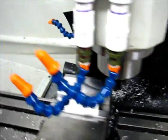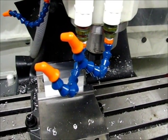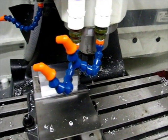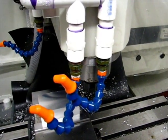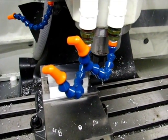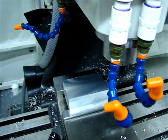What I realized was that the cut that I'm taking, primarily since the table's in the position over this way and the tool's up in this corner when it's in the home position, my primary cuts are going to be coming from over here, going this direction. If I'm climb cutting or doing finishing operations, it'll be headed this direction, which is one thing I showed on that part that had the arcs on it all pointed in the same direction. That'll be the case for a lot of parts I finish, I'm sure. So instead of messing around with it, I decided I'd go for a compromise. I'm going to run a test both directions and see how I like the finish.